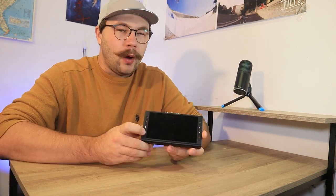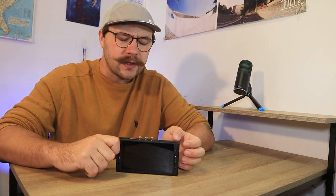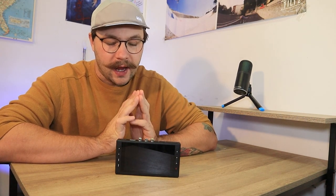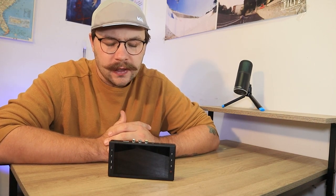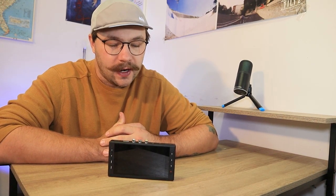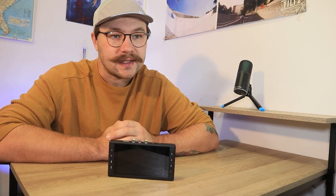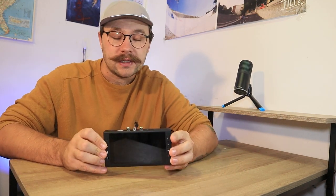I would like to give a couple of recommendations to ClearClick though, if you're watching this. If you ever make a 4.0 or a 3.5 or a 3.2, I don't know if it's possible, but I would like to see one of these have a FireWire port on it. I don't know if it's possible to do that just to have the functionality. It would make this little converter actually so great because when you use FireWire, I think it turns the video files into something that's not compatible with YouTube and stuff. But FireWire gives you the best video signal you can get because FireWire is technically a digital signal, while S-Video and AV signals are technically analog.